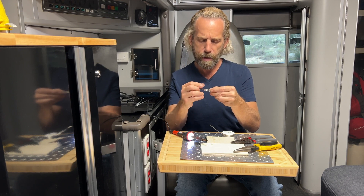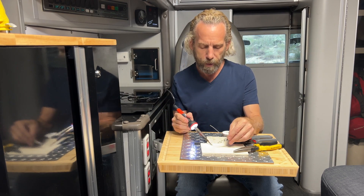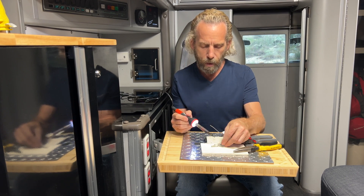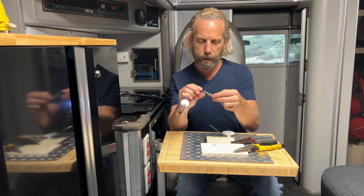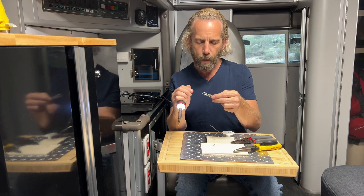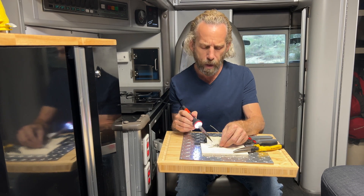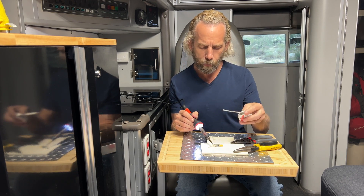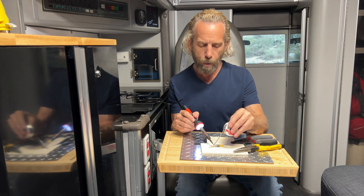I'm going to put it through the pin. There you go, and it's getting warm. You take some of this existing solder and reheat it. The thing about solder is you want a good solder joint, and that basically means that when you're heating the metal, you want the actual metal to heat — not the solder — and that's when it'll have good contact. And then when I'm done, I'll wiggle them and make sure that they're tight. If not, I will go re-solder.